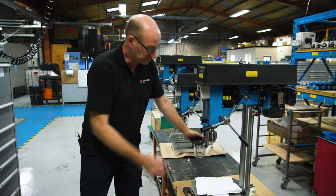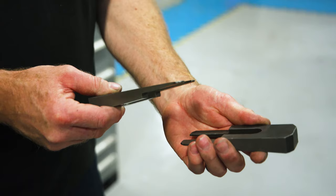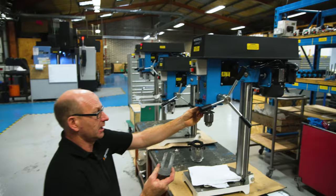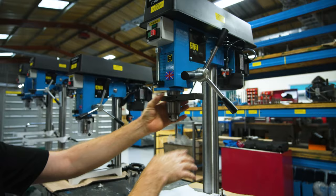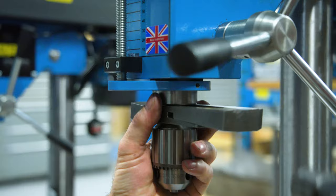I've already taken the guard off — as you can see, that's there just for clarity and also so we don't damage it. What we need are a couple of wedges for the chuck removal. We fit those around the spindle like that, and we can then tap the end of that and it should force the chuck off. I've also just put a cloth there just to protect it in case I do drop it.